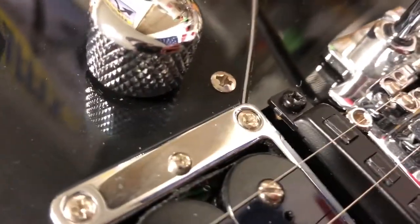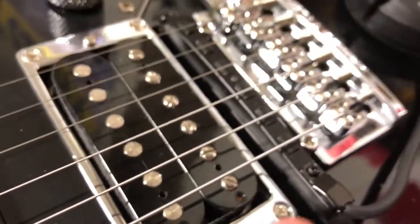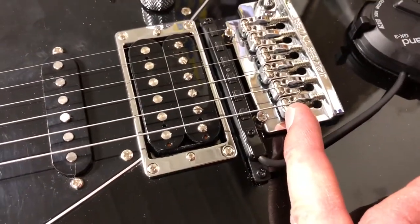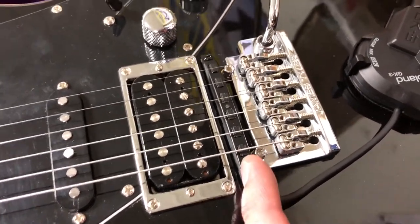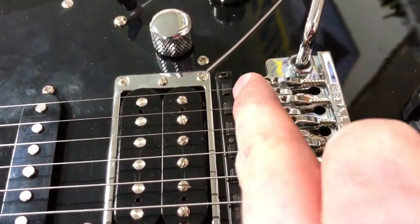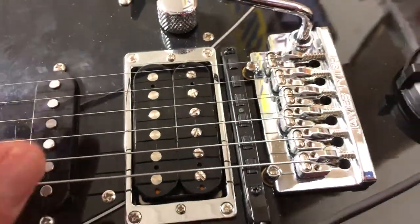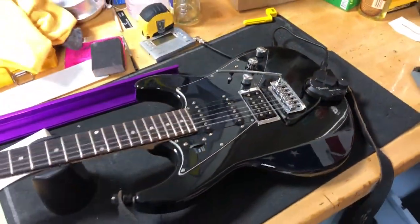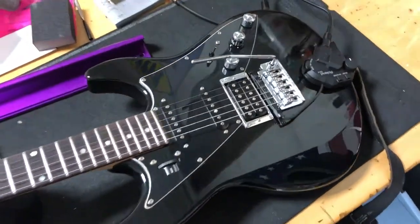This side I did a half — half on the spring, half on the screw — and it set the depth of the strings perfectly. Roland allows 20 millimeters separation between the bridge to the pickup, and this is exactly 20 millimeters. I could not get any further. But I wanted it far enough away from this tremolo so the tremolo wouldn't affect this pickup. So it's installed — the Variax with a Roland GK3 pickup. It is possible, and it kind of adds another tier to your synth guitar playing.